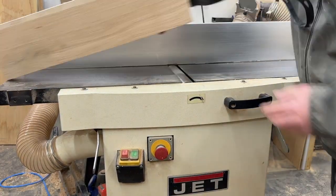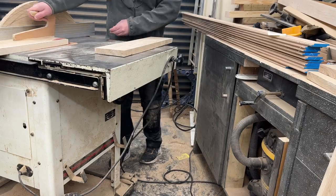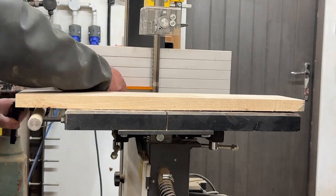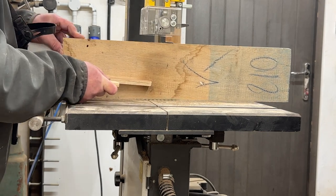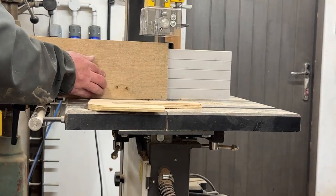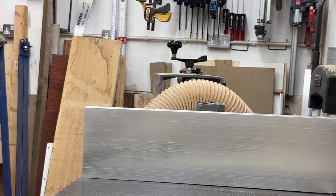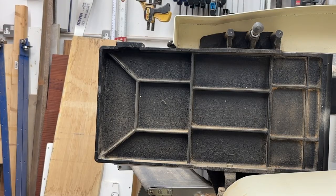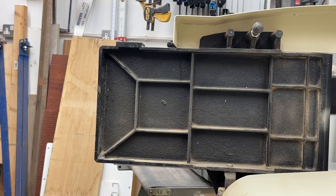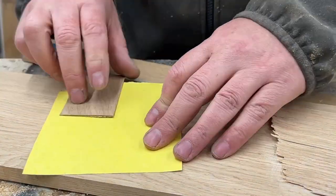Here I'm milling down more timber for the cross braces — the rails. I need two rails, one for the top and one for the bottom. I take it to the bandsaw and resaw it thin enough so that the width of the rail plus the width of the infill equals the same thickness as the two stiles. Originally this was going to be a two-inch door, but when I surveyed the job the metal box section post wasn't strong enough, so we agreed to make it around 24mm thick.